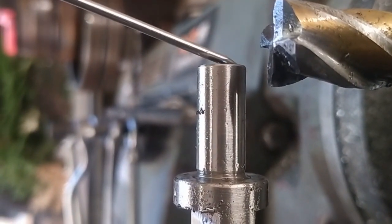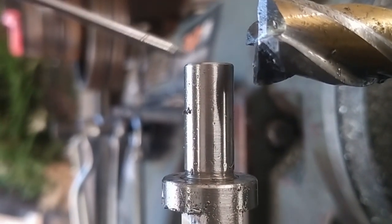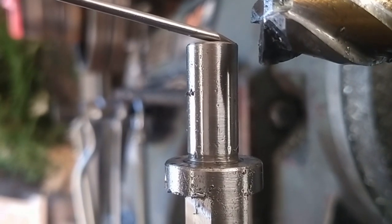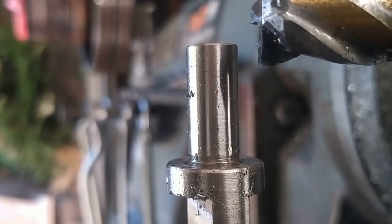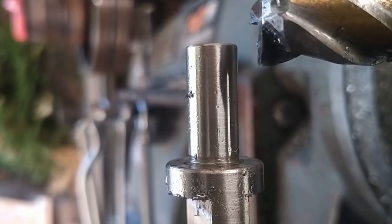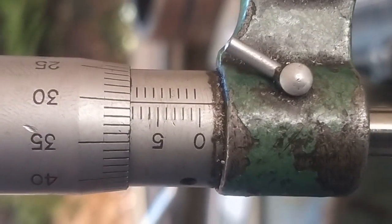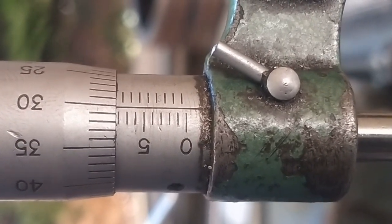Okay, now it's time to put the hex on here. We've backed off 0.6 of a mil from our 7 millimeters, so it's 0.6 per side, which will give us 0.2 above our 8 and 0.1 clean up for our 8mm hex. I'll bring you back when we've done that. So I've got our hex on it at the moment and we're sitting on 8.3. It'll be 0.15 clean up.